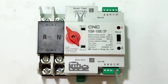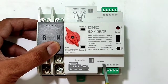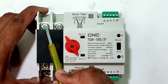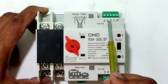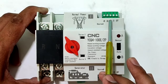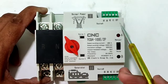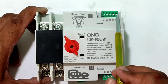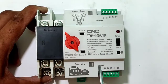Now learn more about the control terminals of this standard automatic changeover switch. For Source A we have control terminals, and for Source B we have control terminals. The first control terminal is AR — we need to connect the phase wire from Source A to AR, and connect neutral to AN from Source A. If you want to connect an external indicator, buzzer, or alarm, you can use the relay terminal — common, NO, and NC — but we already have an indicator in this switch, so we are not using the relay terminal.